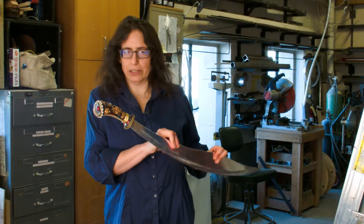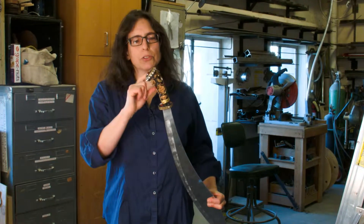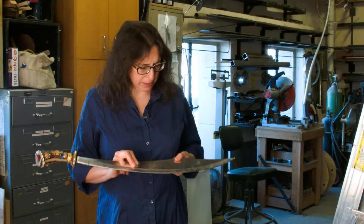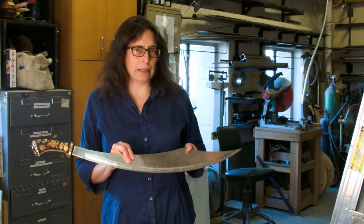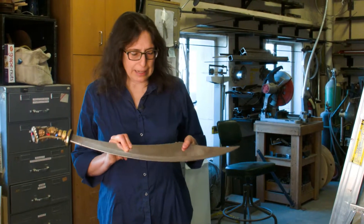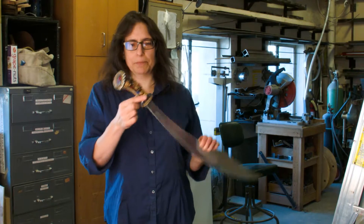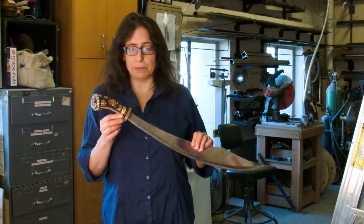A long time ago I actually did the ornamentation on the handle, and we've made it so that the blade goes all the way through, the way that real knives and swords do. It could take a while to build something like this, but we'd probably try to cut it out in just a day, let people use it in rehearsal, make sure it really is the size and shape they want and they can handle it. Then it'll take some time to do the hollow grinding and polishing, and then somebody's going to take some time to actually bejewel it — that can take a little while because we need to use epoxies that take some time to dry.